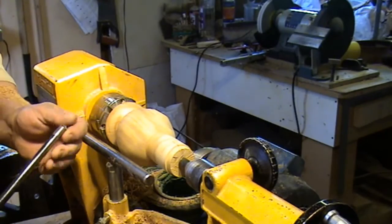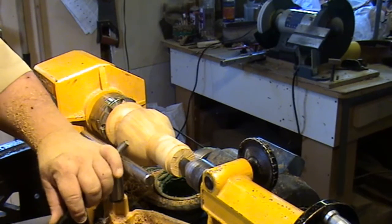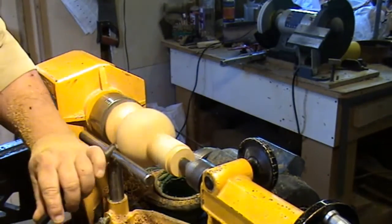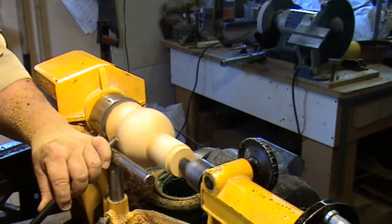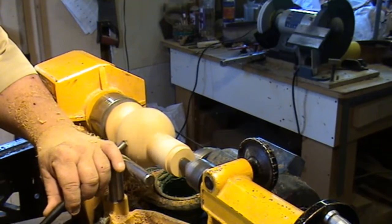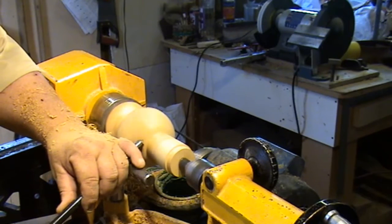This is a 9mm, a bit smaller and easier to use, but I'll be doing the same. I'll be coming in here, I think it's called a shear scrape or a shear cut, using the bevel and just taking as fine a whisk off as I can. Following the ghosting line just around, to take it off till it becomes solid again, so that I lose the ghost.